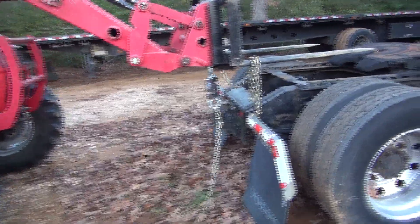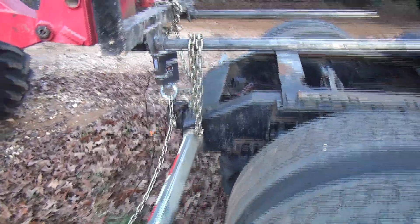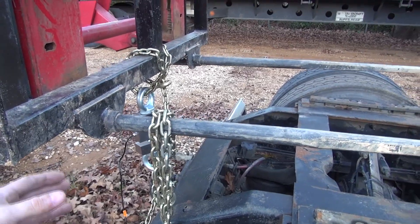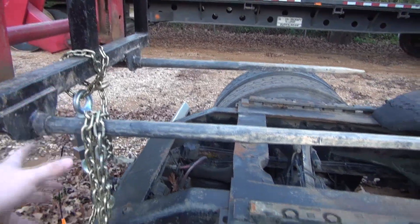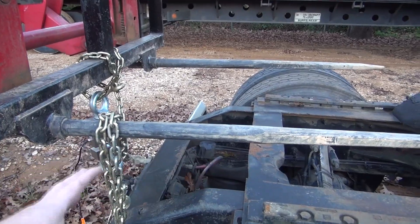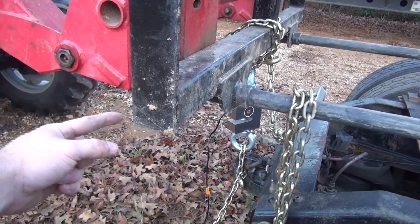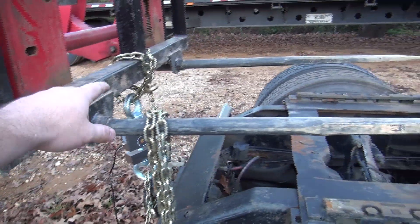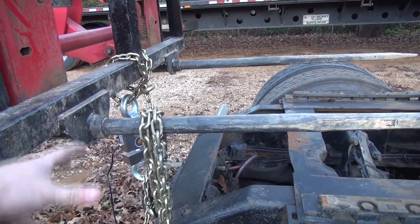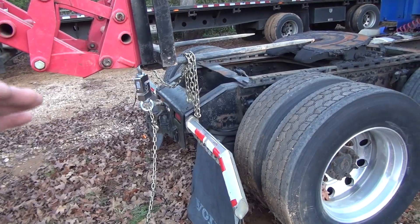I've got the second setup done. This is what you would be doing if you were trying to pick up something off the ground with a chain — you would wrap it around the frame of your pallet forks or hay spear. A bucket would be different; I'll do a test on that later over the hooks on your bucket — but it would be closer to what you get out here because you're coming over the edge of your bucket or rolling your bucket forward to do so. You're going to get more lift up close to the pivot pins. We're still probably 10 or 12 inches forward of the pivot pins where they actually test, but we're going to get what you would normally get picking up right here off the frame of your pallet forks, hay spear, or whatever you've got on there.